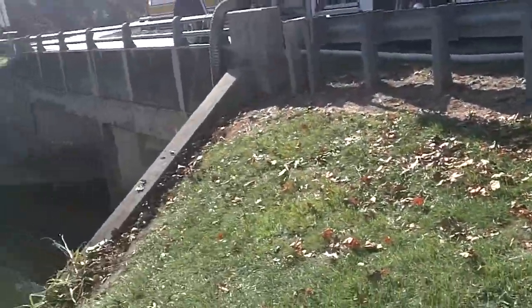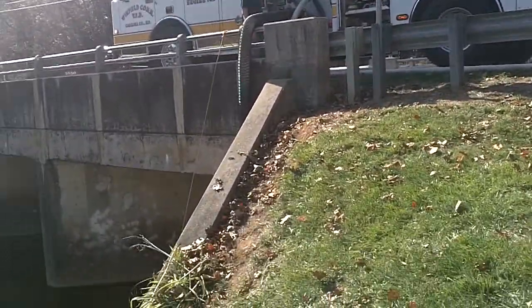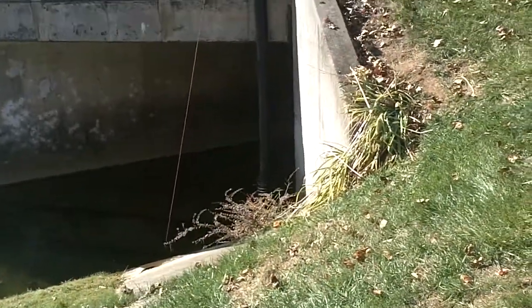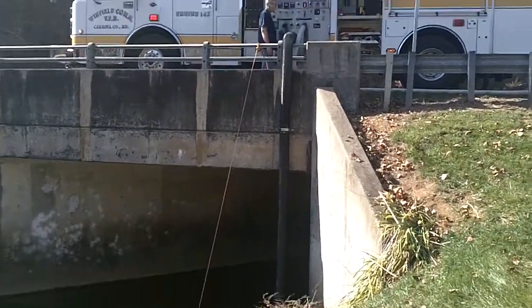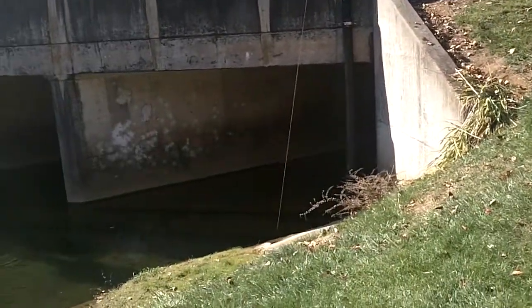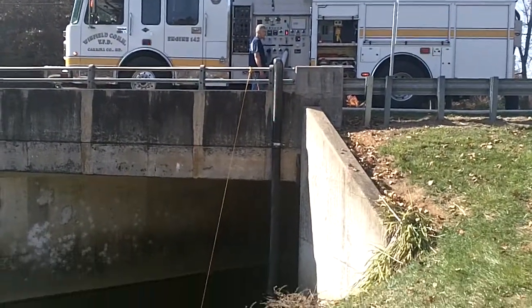I would offer that you need to think about doing this with a rotary vane primer and having to prime for 1.5 or 2 minutes to get your water all the way up to the pumper. Most likely you'd smell that primer smoking or burning, and you'd see it smoking. So from the perspective of this, the high lift does not appear to be a problem for the Trident automatic air primer.